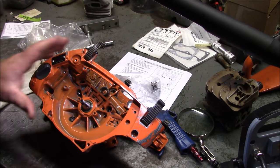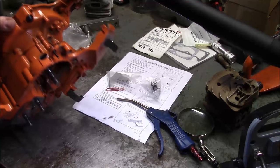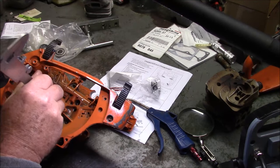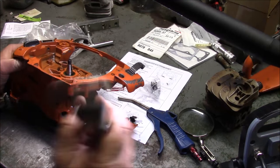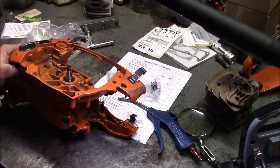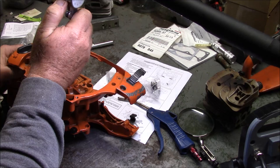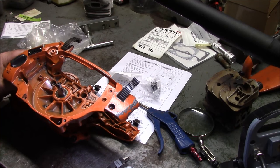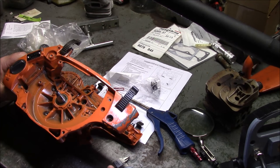Back to the show. This is coming apart. When I do things like this for the first time, I like to observe and just take notice of things. For example, notice that there's a little recess — that seal is recessed in there about 30 thousandths. And I notice that the bearing surface on the crank comes out projected by about 90 thousandths. Whether it's 30 thousandths or not, it's not critical, but it's probably best to replicate what the factory has done.